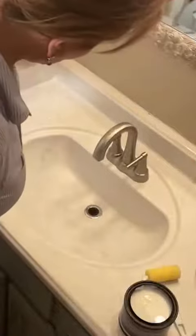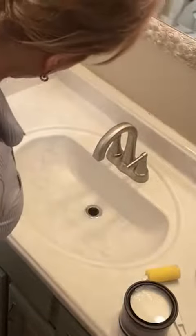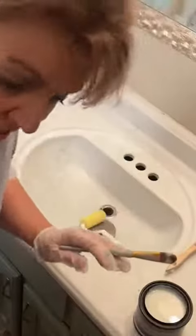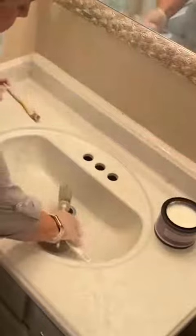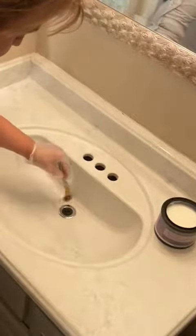So I'm going to go up here and seal the top, and this is important because this is going to catch a lot of dirt through the years. It's also going to be something that you're going to clean and wipe, so I'm going to brush on a real nice, good coat of that. You don't have to take your faucet off. You can leave it also around the drain, and just paint around that. Don't want to paint the top coat sealer on top of that chrome.